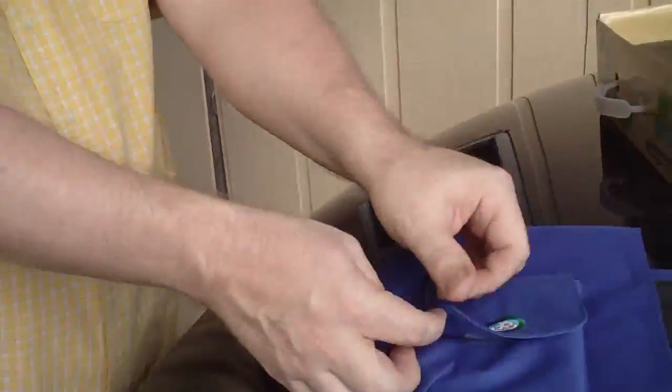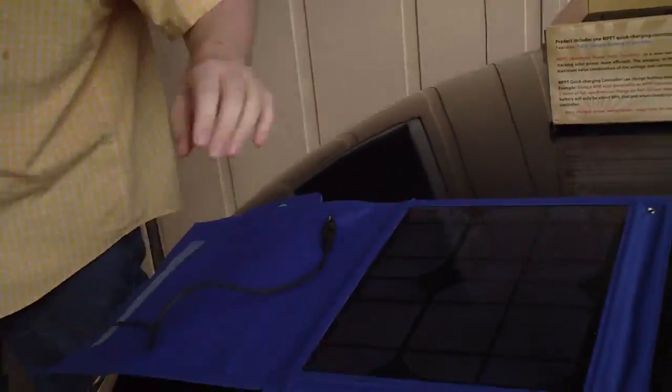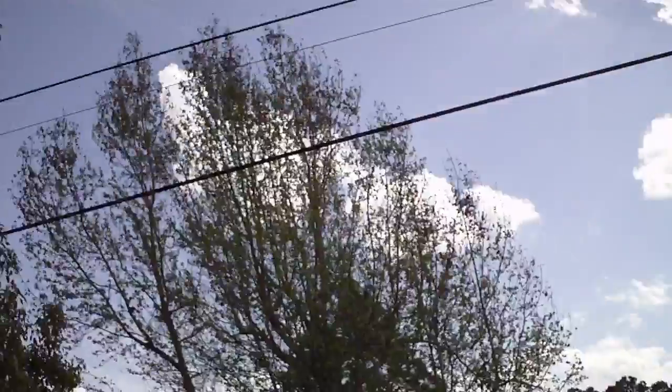This is the array. In this pouch, this little cable comes out here. I've got a multimeter here — we'll measure the voltage that the photovoltaics are generating. Right now it's cloudy; a cloud just passed over. In bright sunlight, it usually puts out a little over 9 volts.